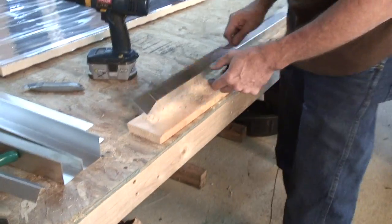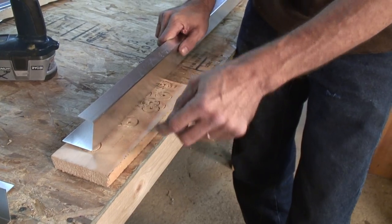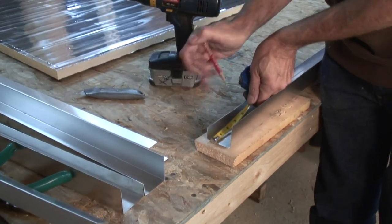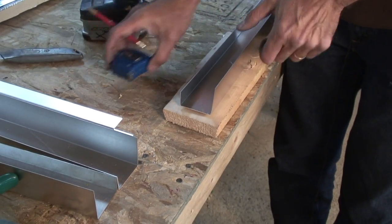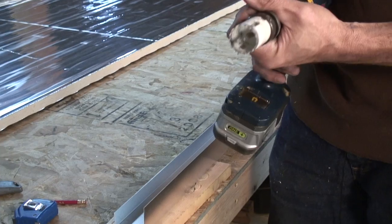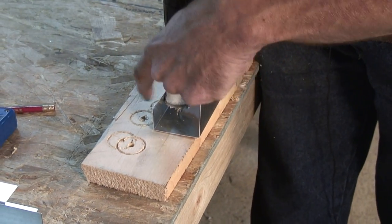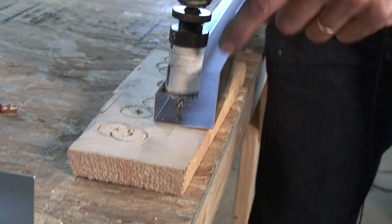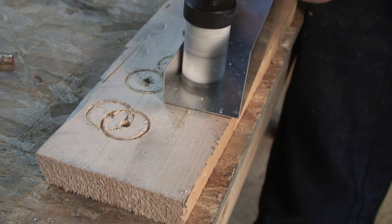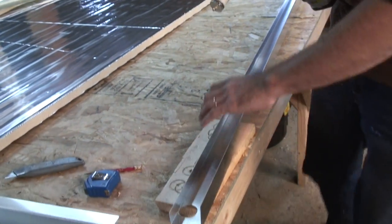So we've got the box that the absorber's going into for the house that Jack built, but we have to have an opening where the manifold comes out so we can connect the collectors together. So we have to drill some holes in the case. And through major research effort on my part, I come in 1 inch on either end. I have a 1 1/8 inch hole saw here, and a piece of wood that goes underneath, and I'm marking the outer edge of the hole. Now one edge is up against the top of the case, and the other is to the outer edge of my mark. If you want to come in and take a look at that from the top, can you see that? Okay, and all we're going to do is drill a hole. Wow, how cool is that?